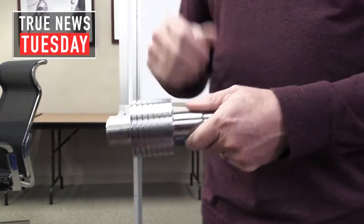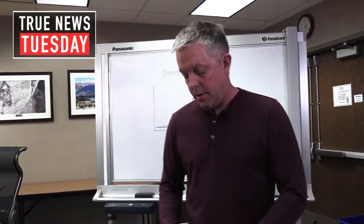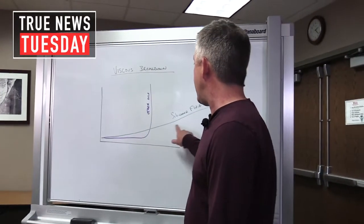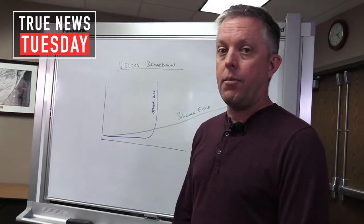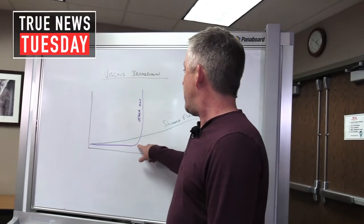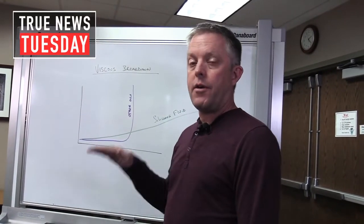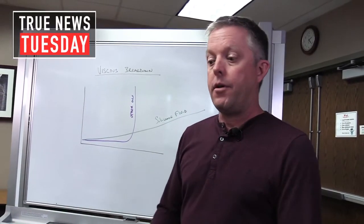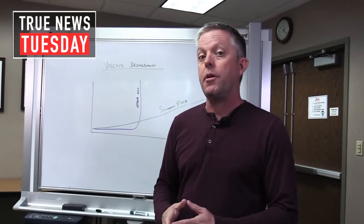Changing the thickness of the fluid helps control the speed of rotation. We design and use this fluid because it has a really long breakdown period. With other oils — different motor oils or other oils in the industry — the viscous breakdown gets to a break-off point and then declines very rapidly. With our silicone fluid it's a very gradual, extended life, which is very important in the field so that you're not suddenly surprised with a tool that's triple or quadruple the speed of rotation.